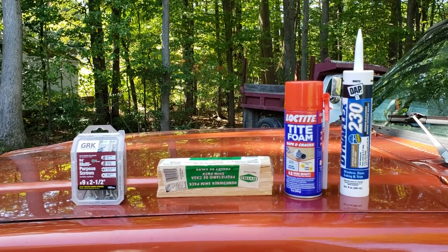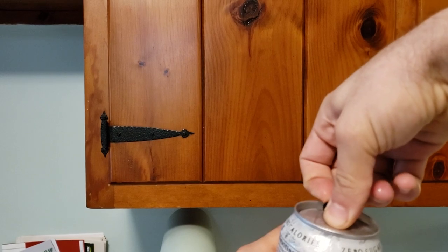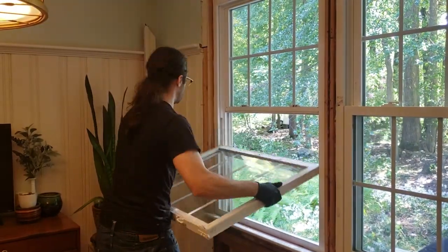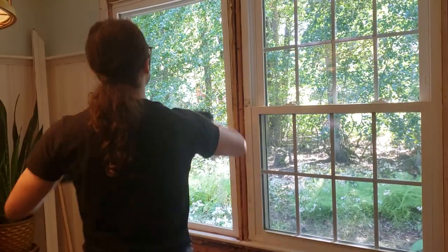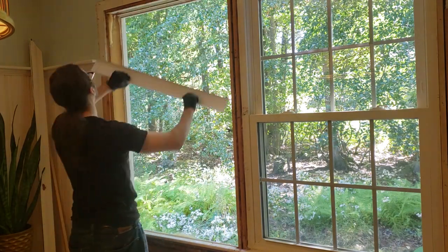You're gonna need all this stuff to install the sliding glass door frame, including shims and two-and-a-half inch framing screws. Remove your windows — if they're in good shape, they're a great candidate for selling used or donation. Removing the window frame, there's probably some hidden screws that are screwed into the jack stud. There may or may not be some caulking and foam you'll have to contend with — just cut that with a box cutter knife, and the frame gets removed.